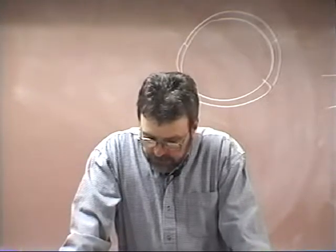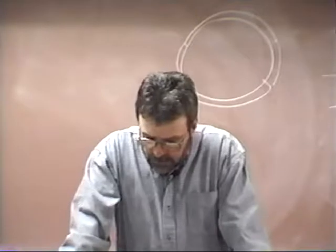Certain steels and all of the higher strength steels are produced by some manufacturers by adding small amounts of columbium and vanadium to gain the required strength. I'd remember those two words. These take the place of an increase in the carbon content, knowing that carbon has a detrimental effect upon fracture toughness. Fracture toughness is a much-needed mechanical property that helps prevent running cracks from developing.